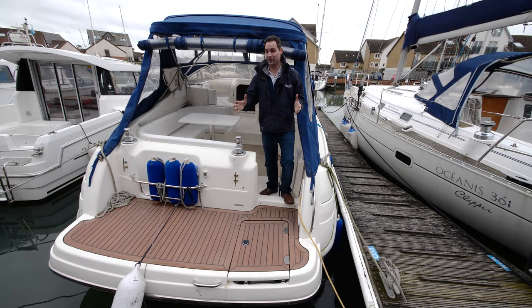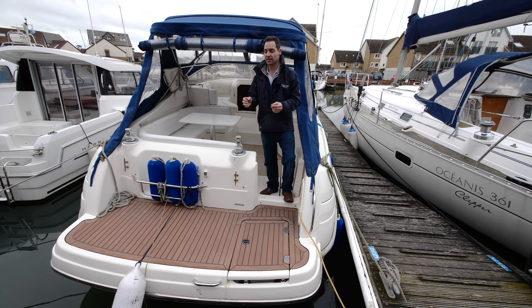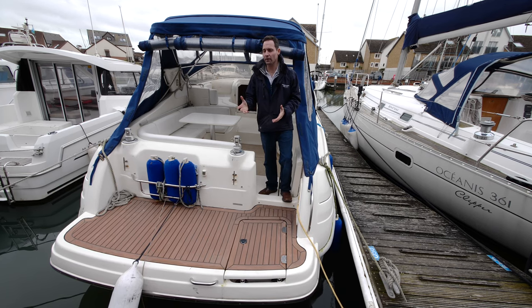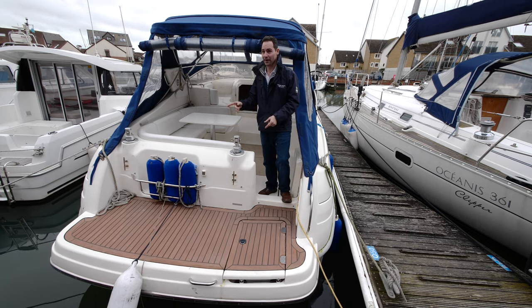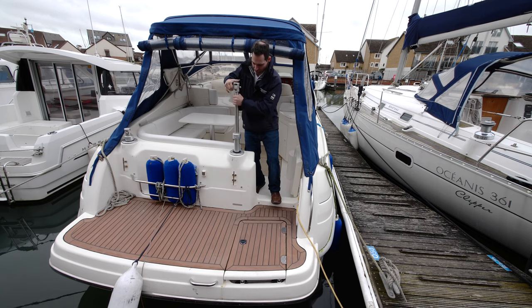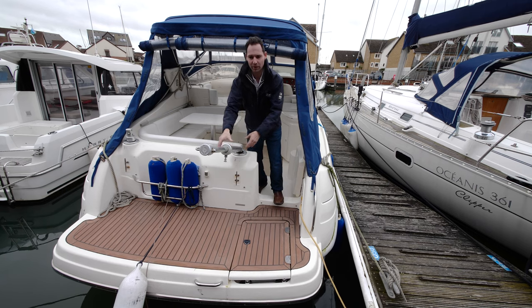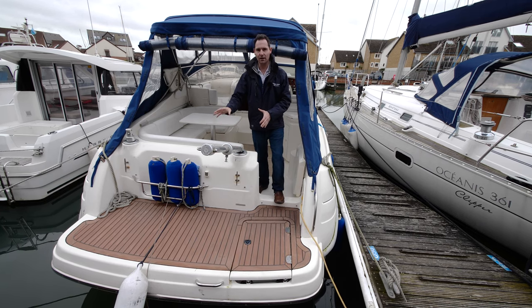Let's start off at the back of the boat. Now, a lot of boats of this sort of size have some form of snapdavit arrangement — a clip onto the tender and a clip onto the bathing platform. It works quite well but you end up with big bulky clips everywhere. This boat has a little hidden secret: telescopic davits. These davits lift straight up, all the way up, then pull out. You can rig a pulley system onto them and very easily store a tender on the bathing platform.